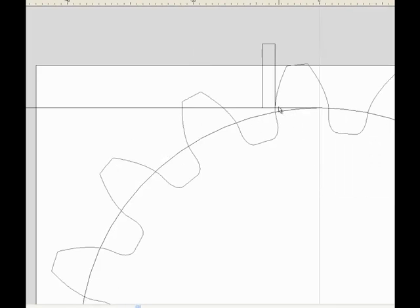Here would be another position, for example, that we could touch. The tool is now tangent to the tooth and will shave from this portion upward. If you were picturing us machining this tooth, you can see that as we move along, going higher and higher up the tooth, and the tool is moving further and further to the left, we'll be shaving an ever decreasing amount of this tooth, and in the end we're going to leave only that involute flank.